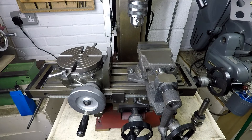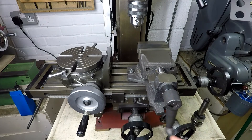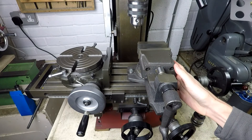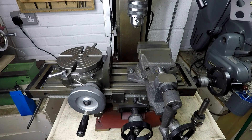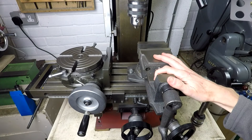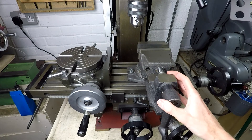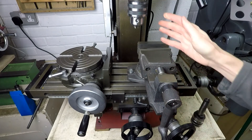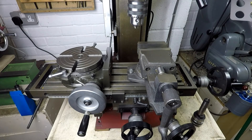Stepping back to the milling machine itself — this is my normal table setup. The four-inch machine vise sits on the right-hand end of the table most of the time, bolted down. I normally keep the rotary table on the left-hand end. It's not actually bolted down here at the moment but that's how I keep it set up. There's plenty of space on the table, so it makes sense to save setup time by having the two accessories more or less permanently set up. Normally I'd have the milling chuck fitted rather than the drill chuck.